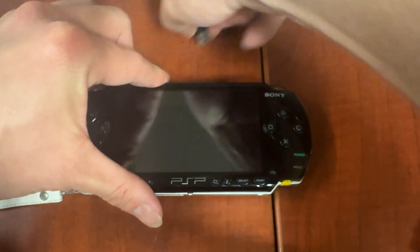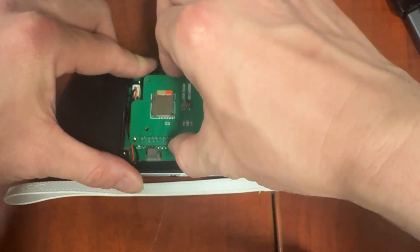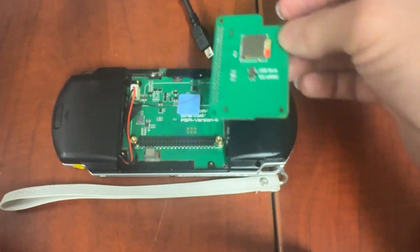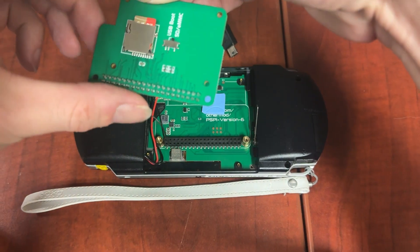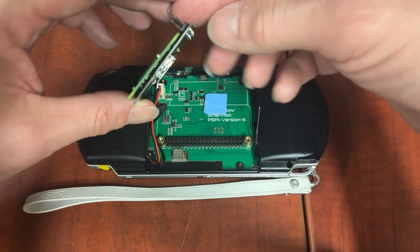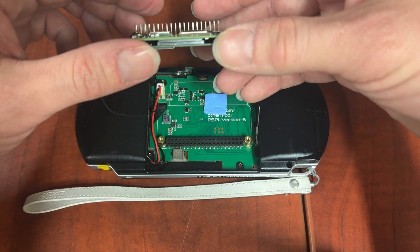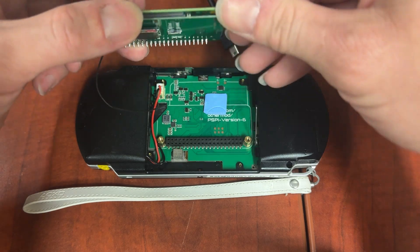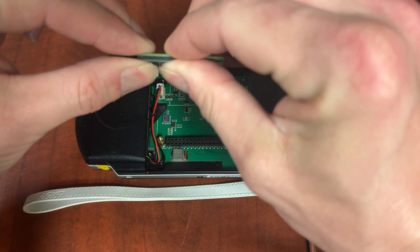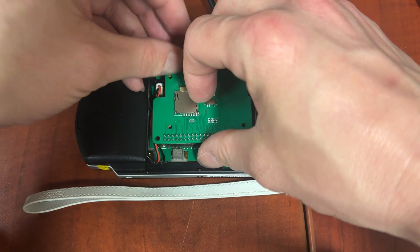On the Raspberry Pi CM4, this is another one of those problems similar to the first one where the Pi is not inserted properly. If you remember, the connector closest to the GPIO was the one that wasn't inserted properly last time - that one takes care of almost all of the operation of the Pi as far as the PSPi is concerned. The other side of the connector only handles USB, and that's the side that's not inserted properly. So we're going to push that down until you hear it click, same as before, and plug it back in.